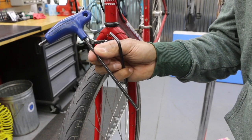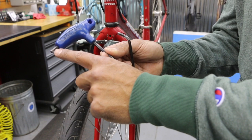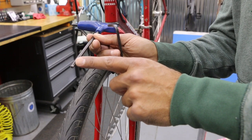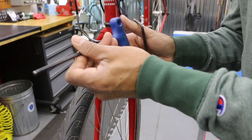We've got this here, which is a T-handle. Great because we have two sides again. This side is more material — it's the non-ball end, so great for tightening or breaking something free. And then once it's loose, we can go to the ball end, just like our L-tool, and we can spin really quickly. So I can hold this in place and give it a quick spin.